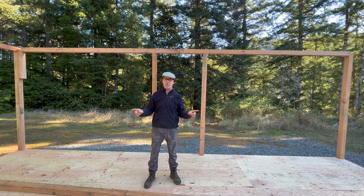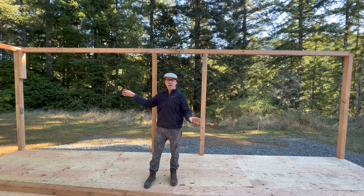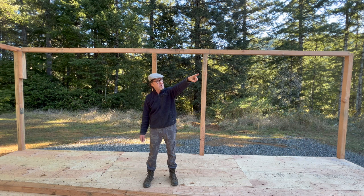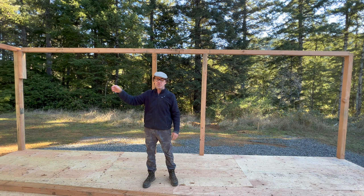I will be doing the same engineering on this side, this 24-foot run. My 16-foot runs are going to be okay because on this end, I'll have the lap joint that'll run halfway into this middle post, and then the other 8-footer will run to a lap joint on that end. So it's really just these two corners where I'm going to have to install these additional posts. No big deal, but thought you might be interested in that.